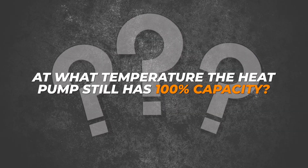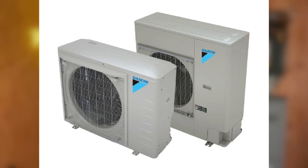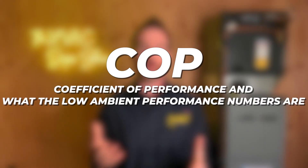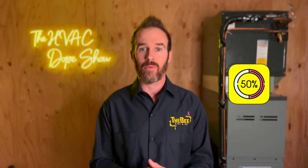The number most important to me when choosing a heat pump for a cold climate is the low ambient rating. I want to know at what temperature the heat pump still has 100% capacity and at what temperature it essentially shuts down and switches over to backup heat. For example, the new enhanced Daikin Fit heat pump, as of September 2023, allows for low ambient heating down to negative 10 Fahrenheit. The next thing to look at is the COP or Coefficient of Performance and what the low ambient performance numbers are.